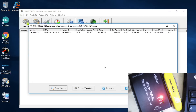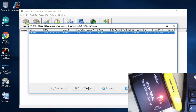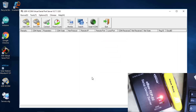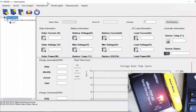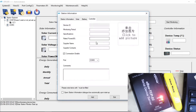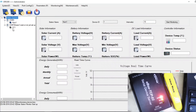Click Set Device and make sure the E-Box is set to a TCP server, click OK, and then connect a virtual COM port. I'll go for COM port 3, and this software needs to act as a TCP client. Click OK and hopefully that will pop up. There we have it — COM port 3 and it even says it's connected. Let's open up the Solar Station Monitor, go to Port Config and select COM port 3, add that in, and then we should be able to add a charge controller.